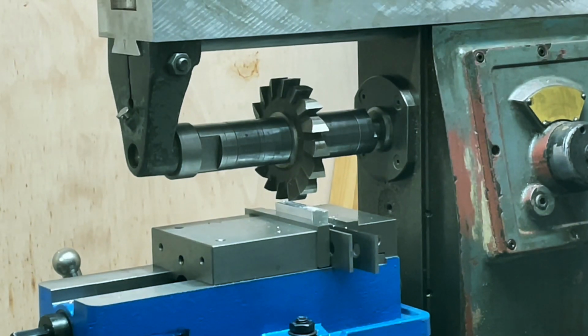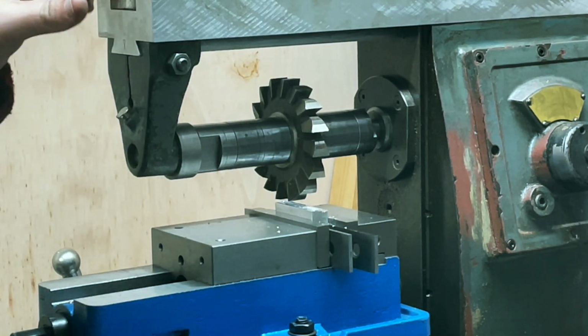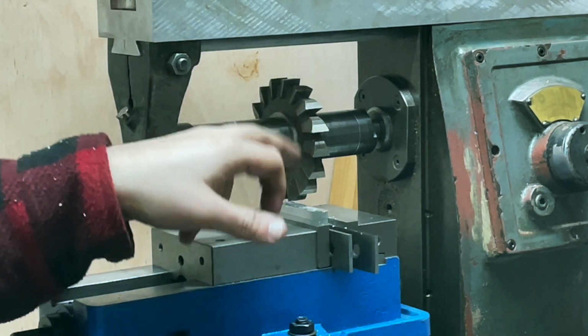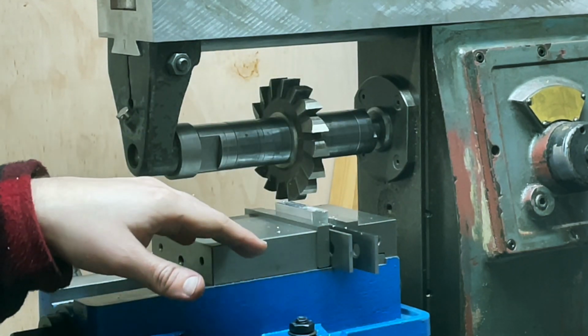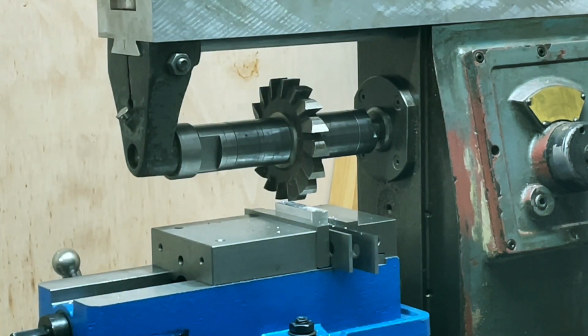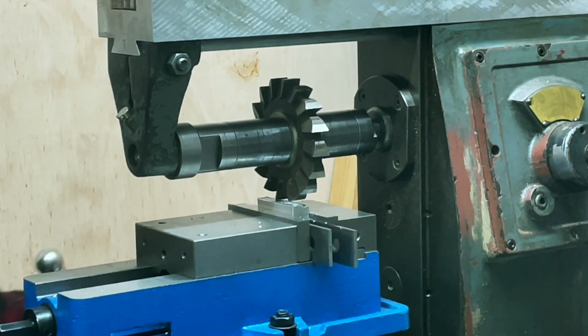To see is the condition of the shoulder, because I want to cut the axle box slots without traversing this left or right. So it's important to know that I'm going to get a nice vertical right angle in there. So I'm going to keep going on this with a little bit deeper this time. Maybe I'll take an even deeper cut. Let's try 75 thou.